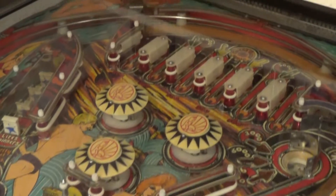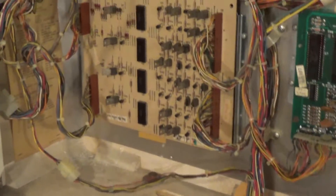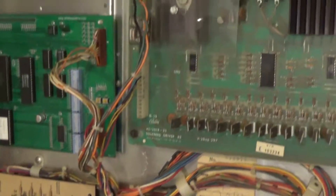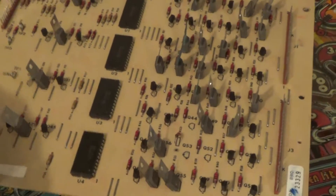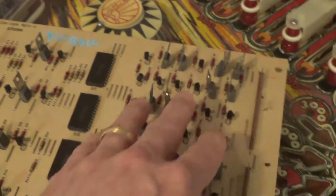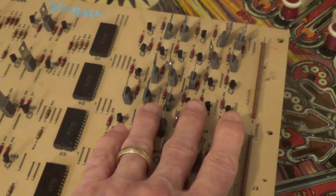Hello, this is you. I'm back in my pinball room, still working on my Bally Future Spa pinball game. Last time I was with you, I was testing out some of these lamp driver boards. You can see all the other boards here. I was trying to get this one and that one working. We were focused on this one because it had the most components out, and a lot of these SCRs were out. I showed you how to test those and how to test the decoder chips. And that worked well for this board.